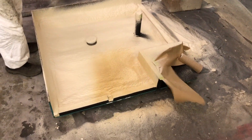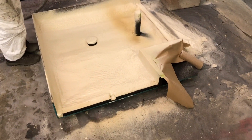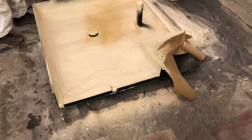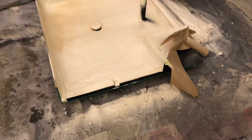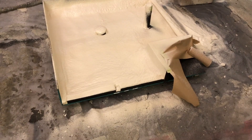We are crisscrossing our passes here to help evenly lay down the foam. We are spraying down two inches of heat shield and getting an R value of about six per inch. Being a three pound foam it will have no issues with denting from hail.